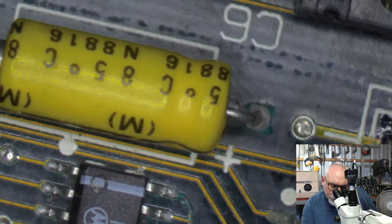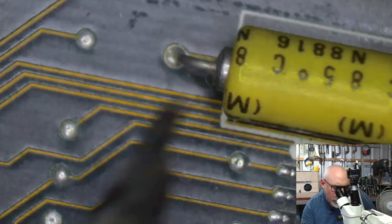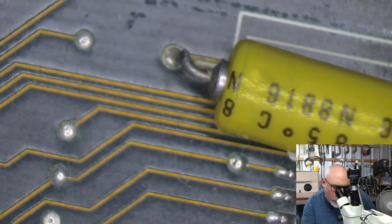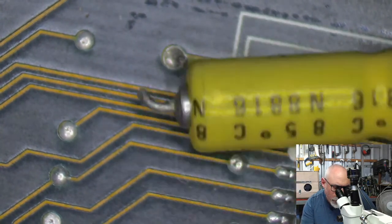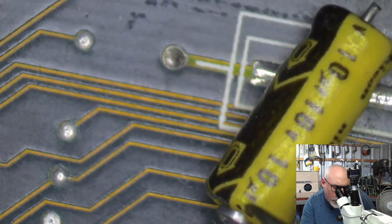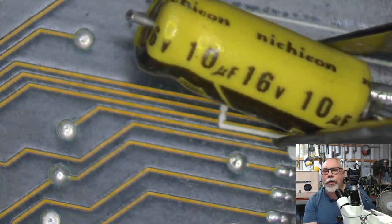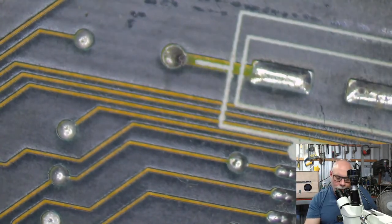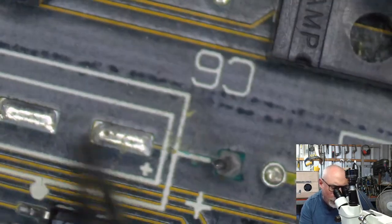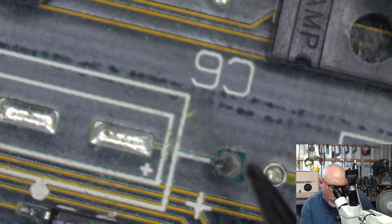Right. Okay. Snip. Snip. Let's have a look at this one. Now, of course, I do have a cheat sheet for this. You'll find a link to it in the description. Here we've got, this is a Nichicon, and it is a 10 microfarad, 16 volt capacitor. So, yeah, I'll need to replace that. As you can see, it's set up to take either axial or surface mount. I will replace this with a surface mount, just because.